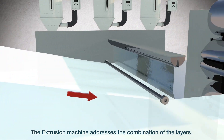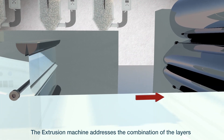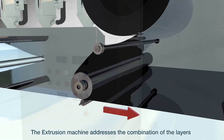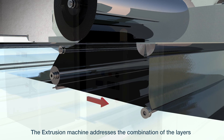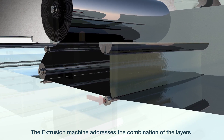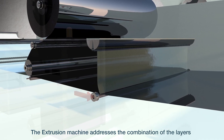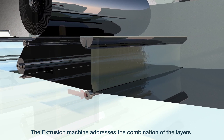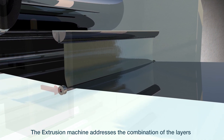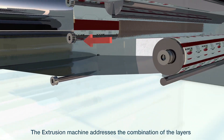The result allows the aseptic packaging carton to provide both rigidity and integrity. In the extrusion coating process, an extruder forces melted thermoplastic resin through a horizontal slot die onto a moving web of substrate, resulting in a permanently coated web structure. Extrusion lamination is a similar process, but the resin is extruded between two substrates and acts as a bonding agent. Inside the extrusion coating and laminating line, the substrates and melt are nipped at the bonding station, consisting of a large water-cooled pressure roll and a water-cooled counter pressure roll. This lamination protects the sterility of the content and prevents any possible leakages.